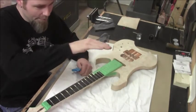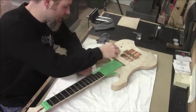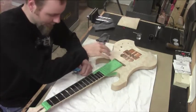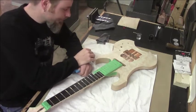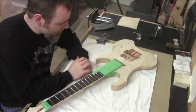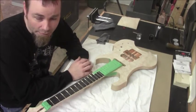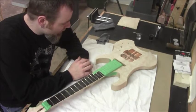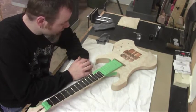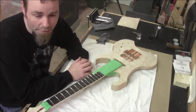What's happening is you're creating end grain on the actual face, mixed with the side grain and top grain. It's these parts with the end grain that give it, you know — when you put a finish on it, the deeper parts, the end grain, take on more of the finish than the top grain does.